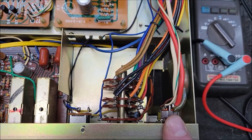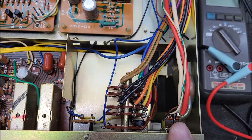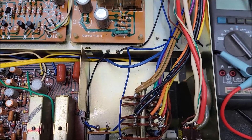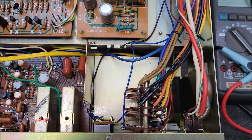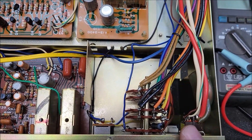But unlike normal, the power switch itself — the AC side — wasn't the problem. The AC side was turning on. Normally when these power switches go bad, they burn the contacts and just flat out don't turn on the AC, or the lights will flicker and they'll arc and spark inside. But in this case, it was the low current side, the low voltage side, over here.